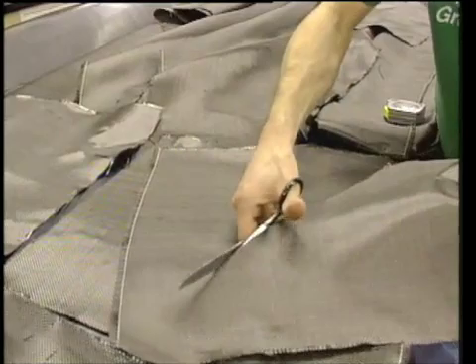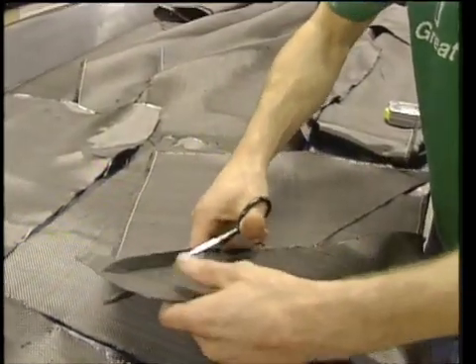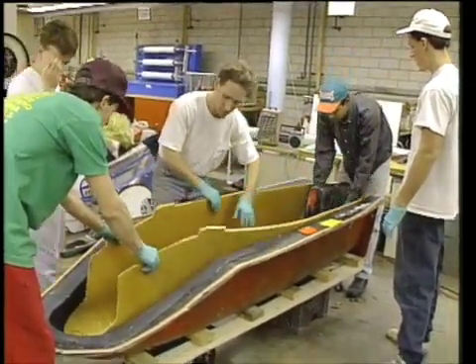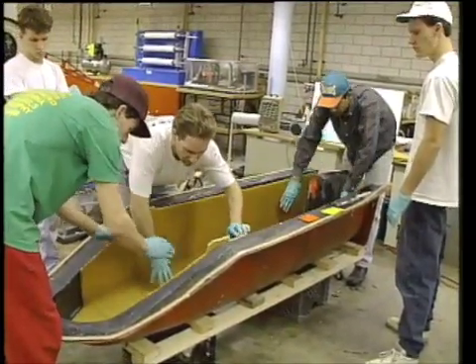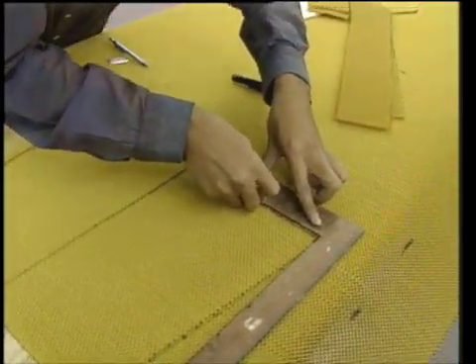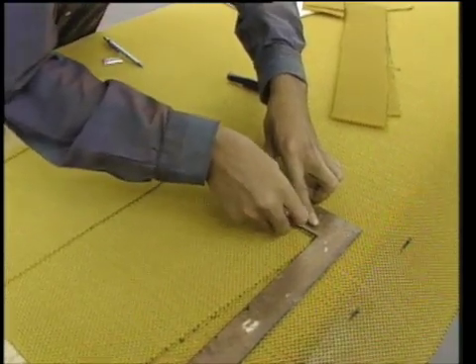A separate template was made for the wheel housing and two triangular pieces were cut following the exact schedule for the lower half of the mold. A separate, full-scale template was also made to cut the Nomex honeycomb. The template for the honeycomb of the lower shell was cut two inches shy of any outer dimensions of the part. This would effectively seal the honeycomb and give the part better resistance to interlaminar peel and shear forces. The two-inch reduction would also allow the inner skin to form a strong mechanical bond to the outer carbon fiber skin. This template was also laid in the mold to verify that it could be placed in one sheet without patching or requiring darts. The template was then traced on the honeycomb and it was cut with a razor blade. The edges of the honeycomb were beveled somewhat, so the transition area would not be as abrupt and likely to entrap air pockets.